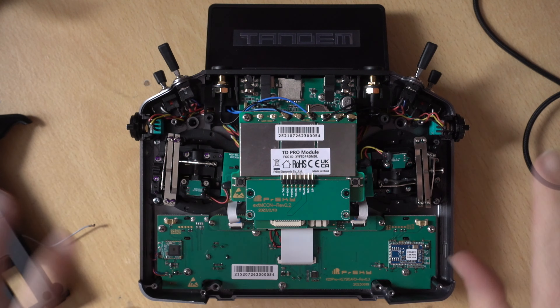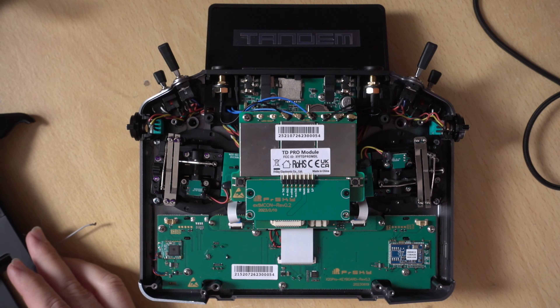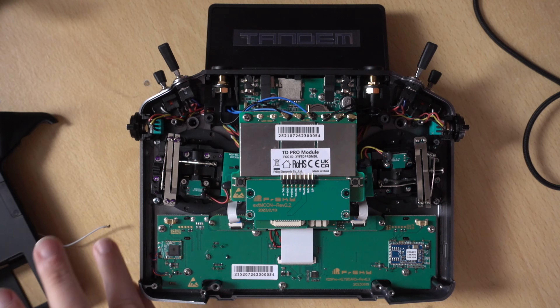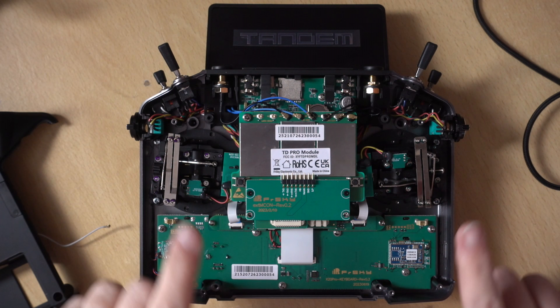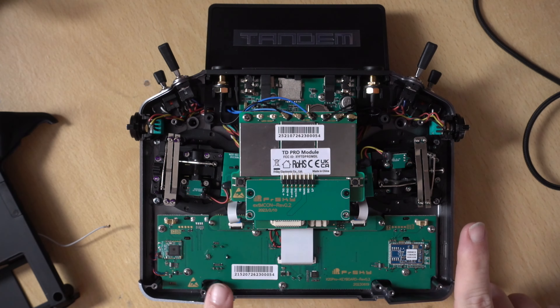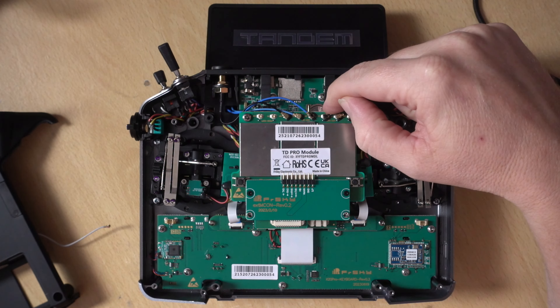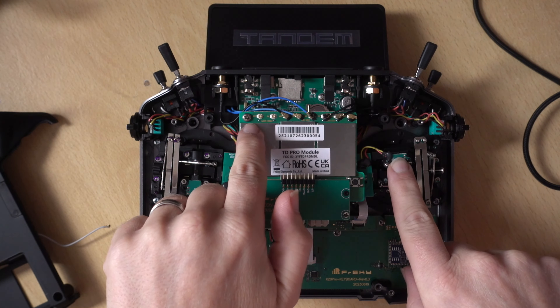So that was the reason I took the back off. The reason I'm making this video is because there are a couple of things that you need to be very careful of when you do take this apart, but we'll get to that later. I just want to identify a few things within this case that you may find interesting. The back is in three parts — there's the central plastic part and then there are two shoulder bumpers. To do most of what you might want to do you only need to remove the side shoulder bumpers. You only need to remove the middle plastic part if you want to change the real-time clock battery, rotate the gimbals, or change the antenna configuration.